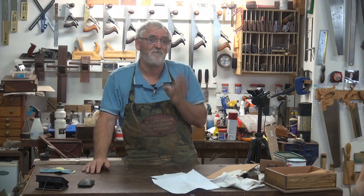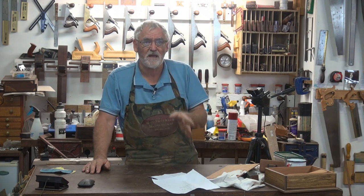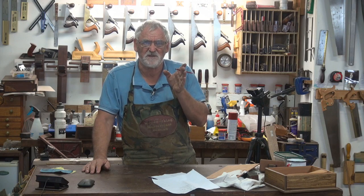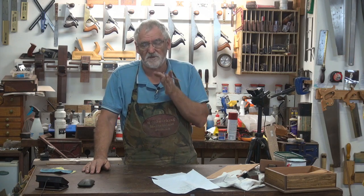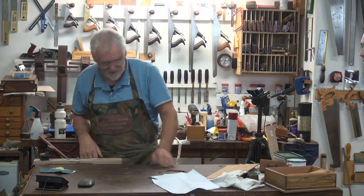And then the shellacs. I do know with shellac, if you put a lot more coats on, gold shellac will go yellow, garnet will go a reddy, crimsony colour. D-wax blonde will give you the same colour as the timber, so that's the clearest. And ebony shellac obviously goes black. So there you go.